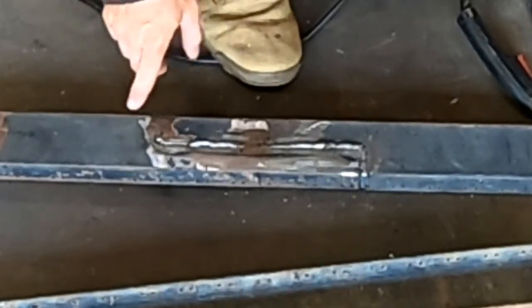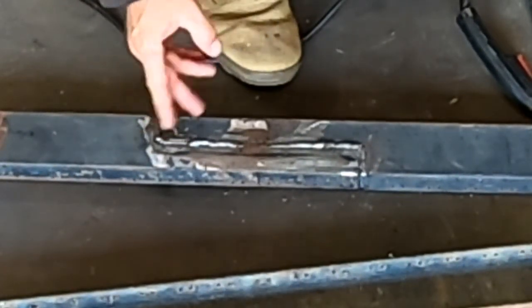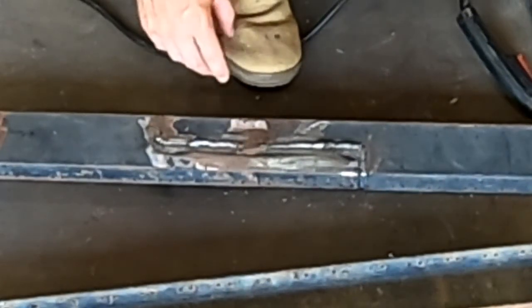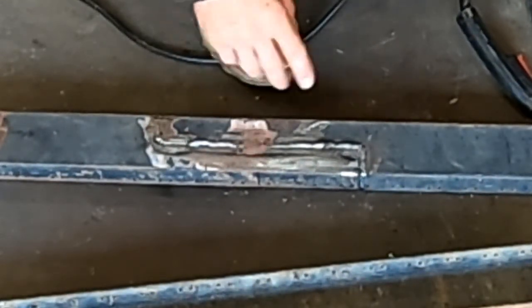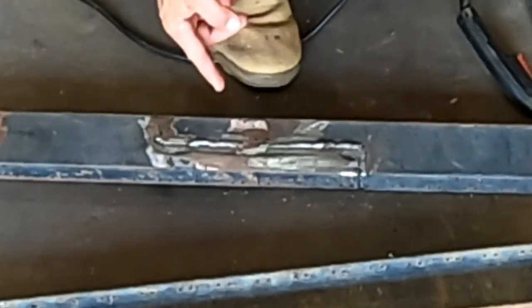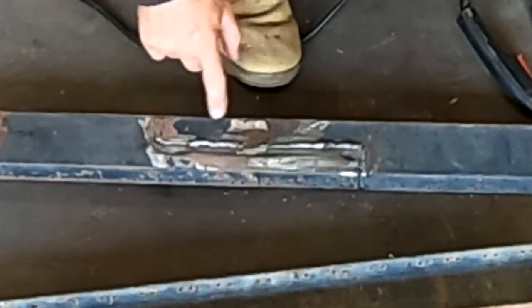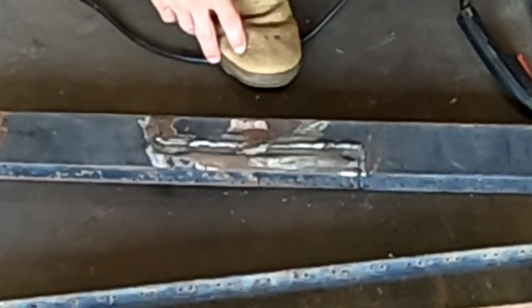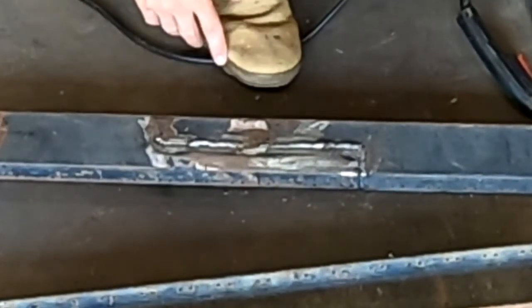All right, so it's all welded up. I gotta fill in a little bit right there. I kind of messed it, I don't know why. But anyway, if you look at the coloration, I got okay penetration. You got to keep the heat on there because I only got a 110 welder. But as you can see right over in here and right there, I kind of ground it down, and we should be able to make this flush. And hopefully you won't notice that it was patched together.